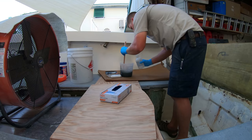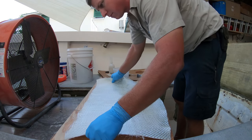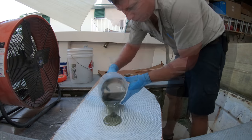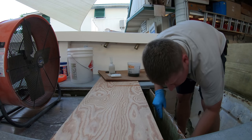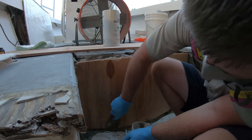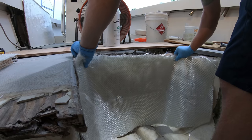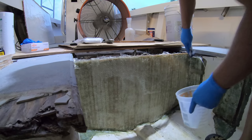We'll suit up with our gloves and then mix up our resin. We want to wet out the wood first then set our inside piece of glass onto the wood. Pour on some resin and start pushing the resin around until we've saturated the glass the best that we can. Then we can stick the panel into place and get it set right where we want it to be. Once it's in place we'll wet it out and mix up some silica into the resin and fill in all the gaps around the piece with a putty knife. Getting our side tabs to lay against the stringers as well as the hull of the boat.